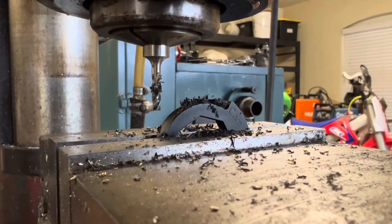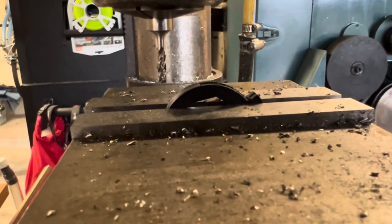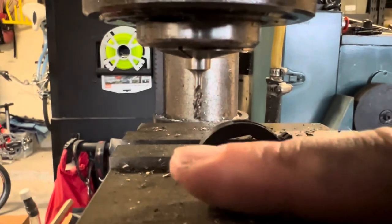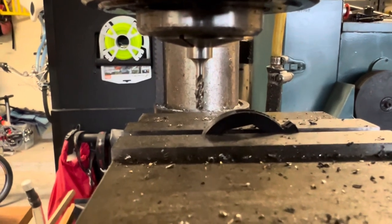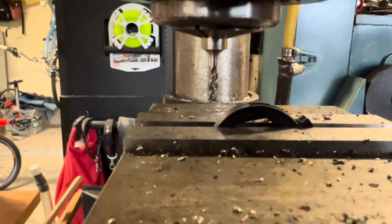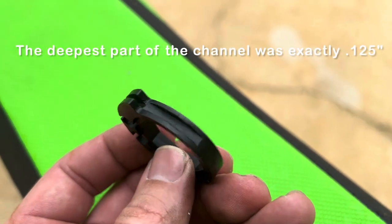I've cleaned it up with a razor. Now I've rotated the cam in the vice a little bit and we're going to take another very short flat cut — it'll help give that hard transition right here a bit of a soften so it's not so abrupt.